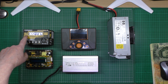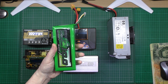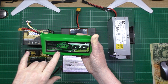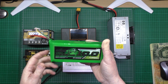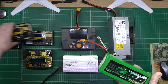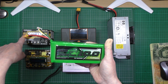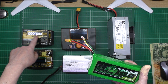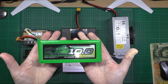This one's a 50 watt power supply. If I want to charge this 4S battery at 1C, that will be 10 amps. That 50 watt supply wouldn't do it. Even an 80 watt supply wouldn't do it. In actual fact, that 50 watt would charge this battery at 2.9 amps maximum. Even if you set it to 10 amps, it'll come up and say something like 3 amps — the absolute maximum output at 16.8 volts, which is what this battery needs.